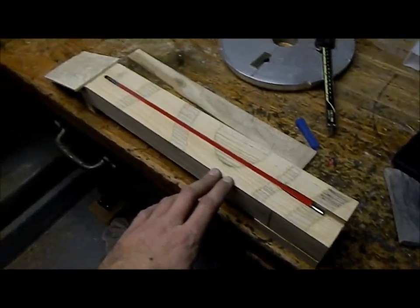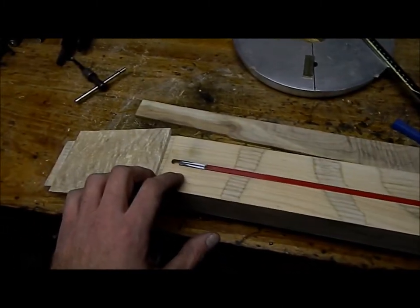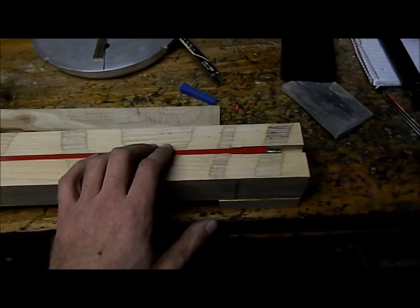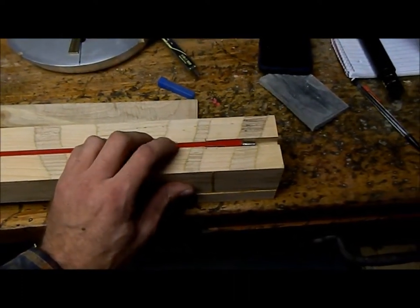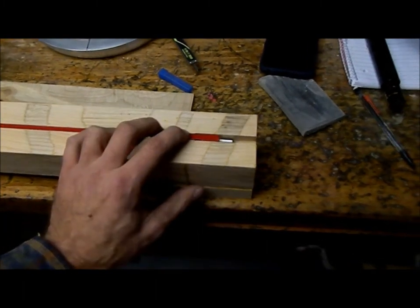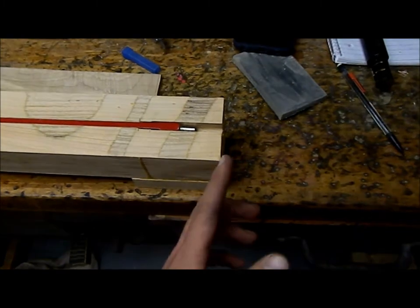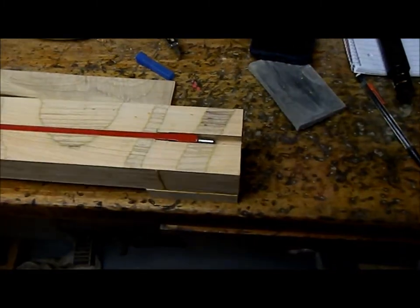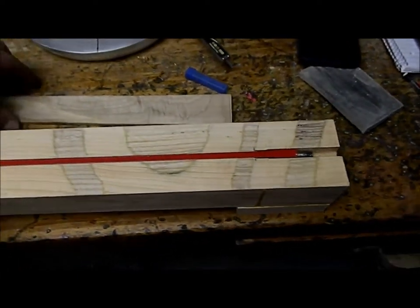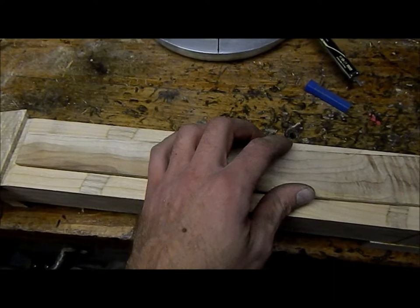Okay, so we milled out our track for our truss rod on the mill, and that's just how I like to fit them. Fit nice and tight, and they are just flush with the surface, so they're a nice tight fit when that fretboard glues on. And I leave myself room here, because I'm gonna have to cut this heel off, so I always give myself room to do things. So we're gonna put our fretboard on over this, centered, best as we can.